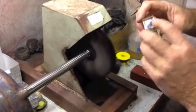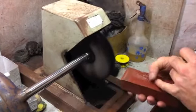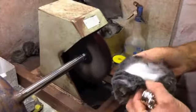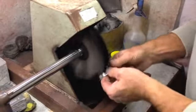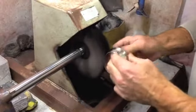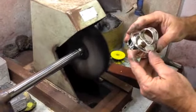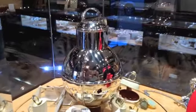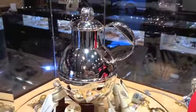Now what I'm going to do is just finish the cover — the lid — by polishing it like we do the milk can, on the high speed polishing motor here. I'm going to go with the very fine rouge, and all that these are are just layers and layers of cloth that bind together very tightly. You can see it's so fine it doesn't scratch. There we are — that's the cover now finished. I'll just do the same with the milk can and then the whole item is now complete. Here is the finished milk can. I hope you've all enjoyed watching me make it. Call back from time to time to see any new videos that we're producing.